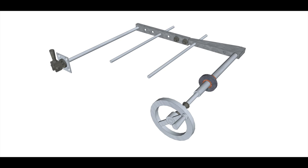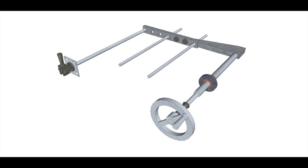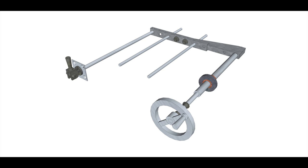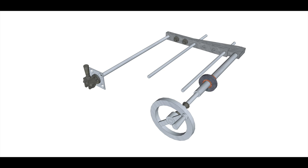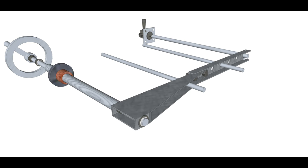So here's what we're thinking for the final design. So you notice right away that this vise is expandable. It can be set up for different distances between the two rods from about 22 inches to 14 inches and still have two bars to track and not bounce in each one of those setups. And the material of construction for the back plate is a tube steel piece cut diagonally to save material and a U-channel. And these are common forms but very strong forms, so they'll be both strong and affordable.